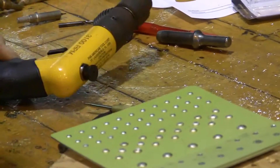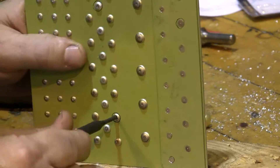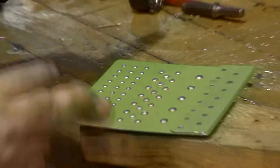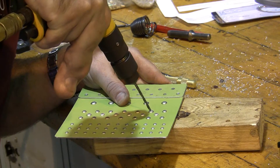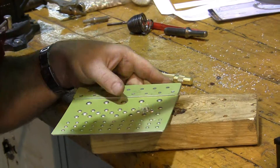I'm going to drill down into the rivet until I reach about the level of the base metal, and then I'm going to grab my pin punch. I feel like I'm still off to the side, so I'm going to push it back towards the center, and then come down into the rivet — that should be good.